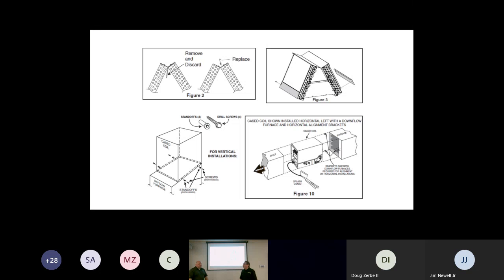What happens is the airflow is being pushed down the side of that coil, and once it hits the very bottom and comes out, we're blowing the water droplets off there. How I was able to see this, and I'll just throw this tip out, guys, if you're ever dealing with water management issues as a service tech: one of the tools that I carry in my truck is a piece of plexiglass.